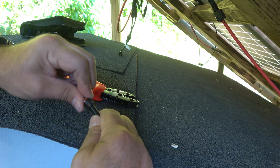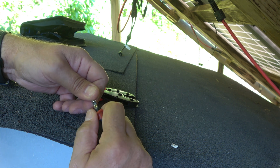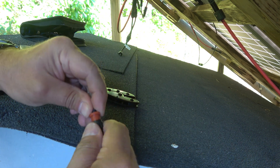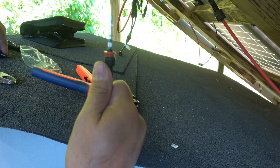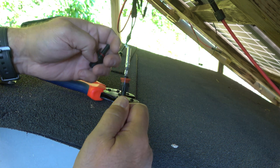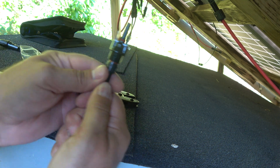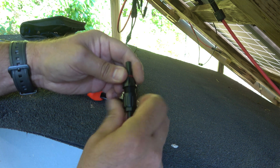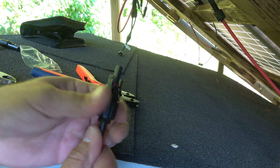We've got that upside down — the compression fitting should be facing down — and we're going to push that into place. Sometimes it's easier if you separate it. That seal is protecting against water coming up in here. Put this piece back on there, and we are ready to insert our top. Now it may be hard to see, but there are little tiny catches right here and here — little barbs, and those are one way. So when I stick this on it locks into place. You can see the rubber right around that seal, and when we thread this on, it squeezes that rubber fitting and squishes it forward to waterproof it.